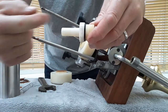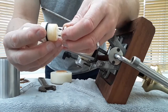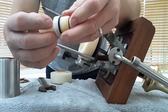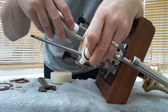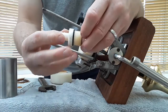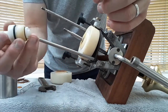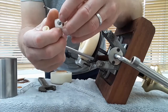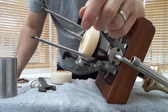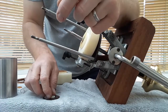So as the pump is pulling or sucking the beer through, this opens up with the spring obviously pushing against it. It opens and allows beer through, and as soon as you stop pumping, the pressure behind it and the spring forces that closed, and it stops the chamber from emptying beer out, and then you end up with just air inside here every time you go and attempt to pour a pint. So it's a non-return, stopping the chamber from dropping out and ending up with an airlock. So again, O-rings, just a clean up. Try not to do too much with them. And the spring. So that's taking it apart. And again, if you can source the parts, please give me a comment down below.